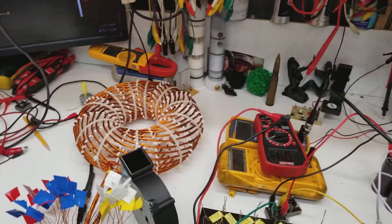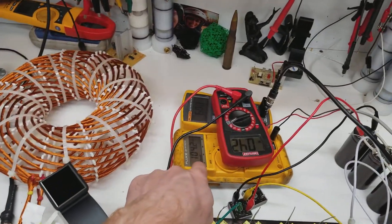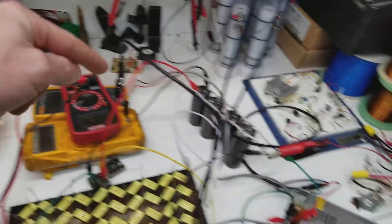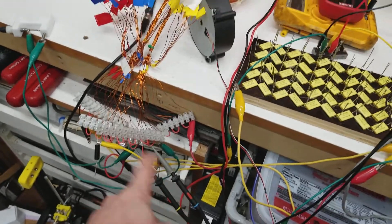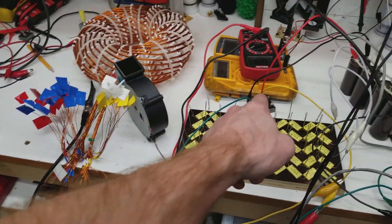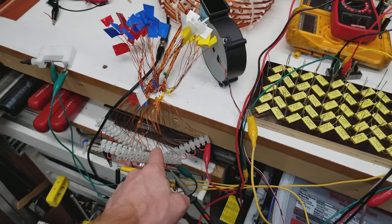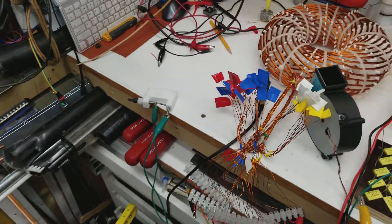Obviously there's a huge field being thrown off, but this is occurring across this fan — this is the voltage going into that capacitor bank, this is the voltage coming out of this power supply. These meters go ballistic when this thing gets firing up. I've got one side of the secondary going to the bridge rectifier, the other side going to the bridge rectifier, and on the middle of the other side where it's usually open I put a spark gap.